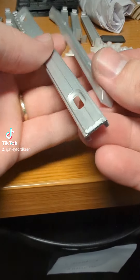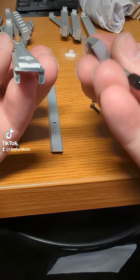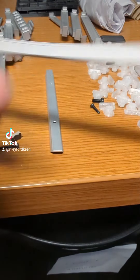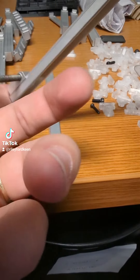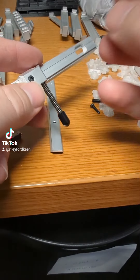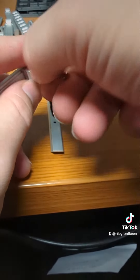The same dovetail geometry is built into the profiles of both of these rails. So all you have to do is take any number of these electromechanical bolt-ons and gently slide it on the edge. That allows it to easily slide back and forth anywhere along the perimeter of your device until you take just a simple M2 screwdriver, give it a quick tighten, and now this interface is incredibly robust.